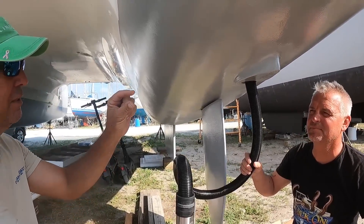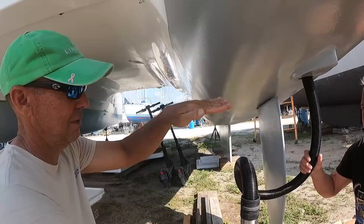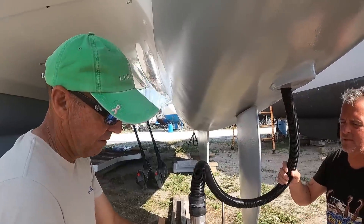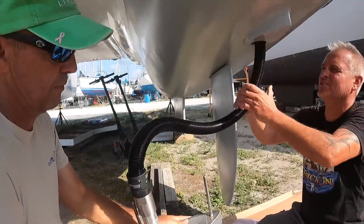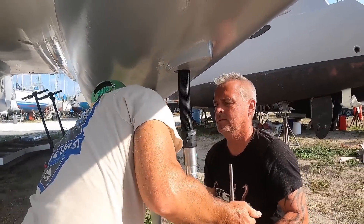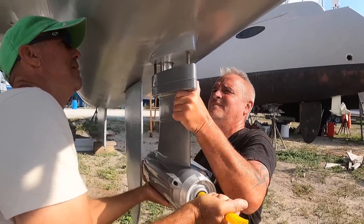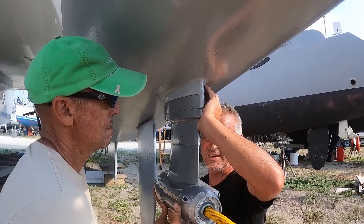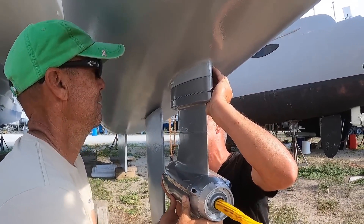What I want to do is take some thickened epoxy and make a little flat surface above those holes so that the washer can sit. I have a bigger washer but it's too wide here, so I need to grind the washer away a little bit — cut the edge off and then it can go right on. Didn't get as much paint in the holes on this one. Could be — probably got epoxy primer in the other one.